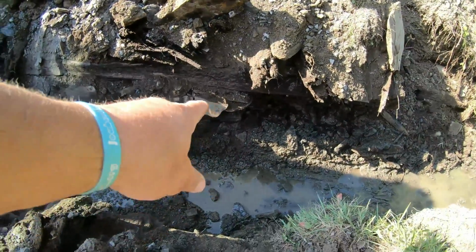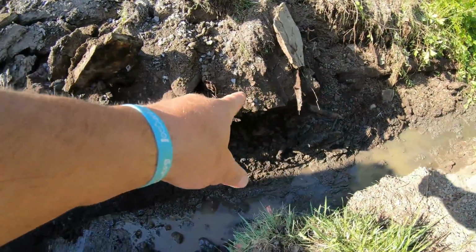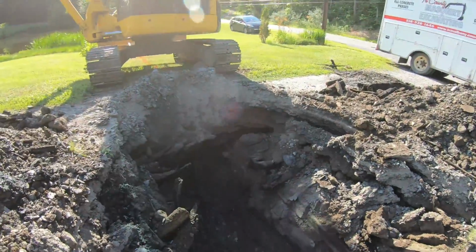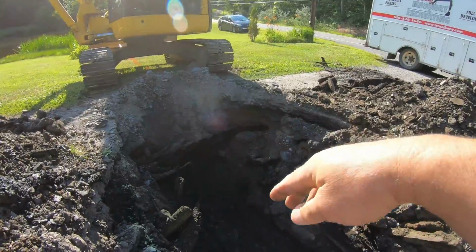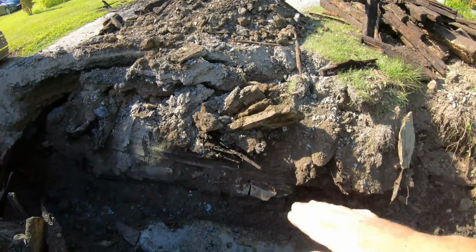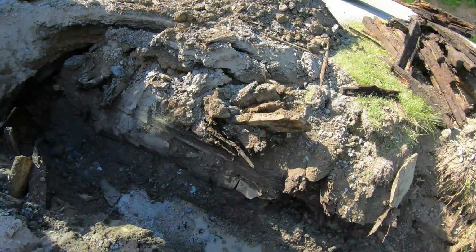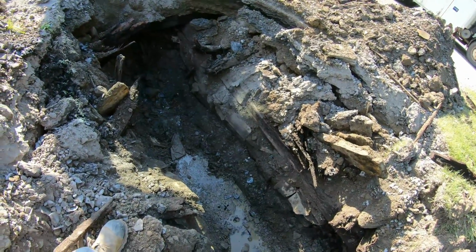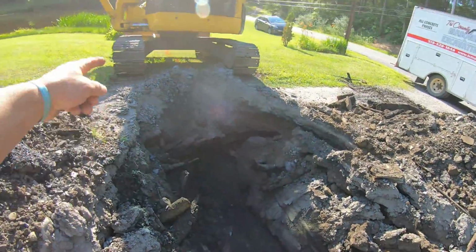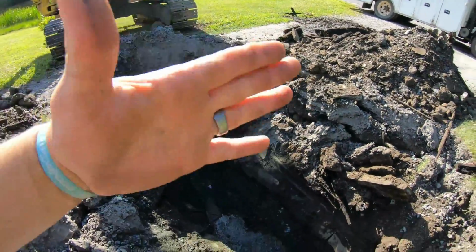It's all rock under there. We got that one railroad tie right here that has to get pulled out, and some stuff right here. But you see how they're under there. I don't want to keep yanking until I get pipes in, and then I can pull it back this way. After that pipe's in, anything that falls in that's good material will go in along the pipe. Otherwise I'll have a 10-foot wide excavation here and I won't be able to track close this way.